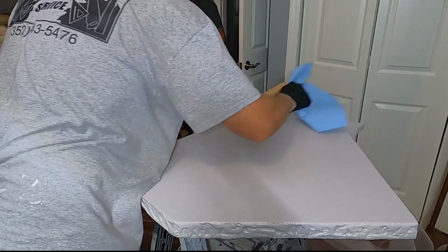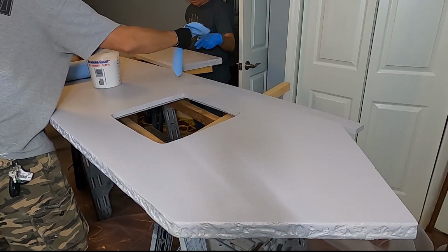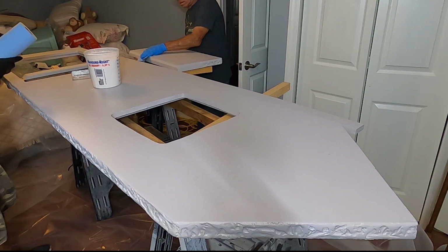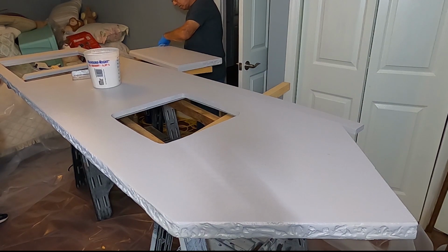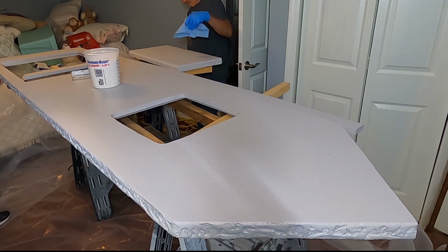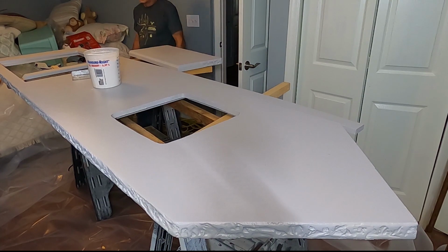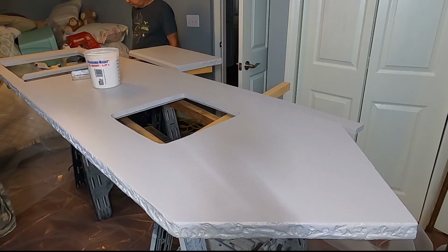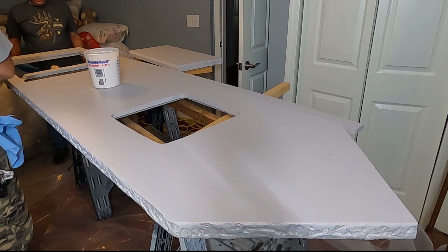I know you can tint them with metallic powders. You can tint with Rust-Oleum paints. And the biggest takeaway from that is to use it sparingly. If you add too much of a percentage of anything to the epoxy, you're basically changing the formula. So you want to retain your maximum hardness and durability. So you only want to use as little as you can get away with.